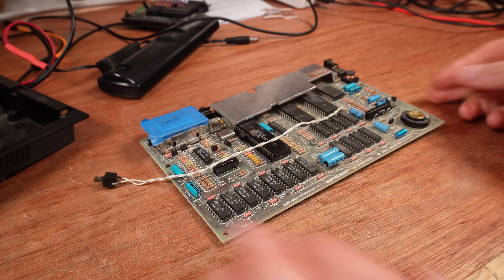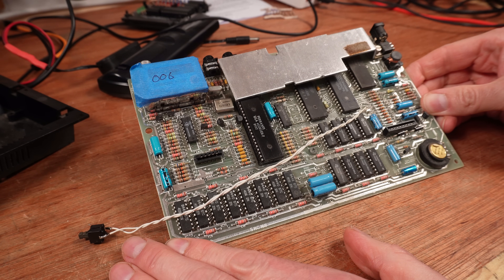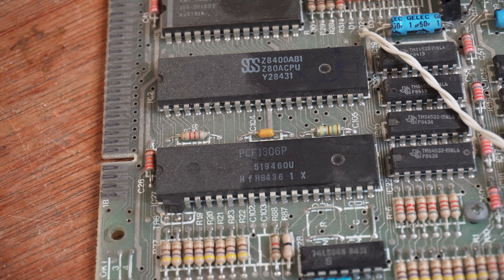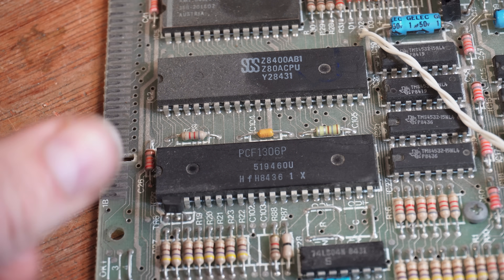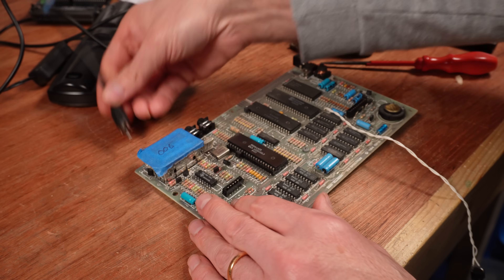This revision of motherboard is the final one before Sinclair upgraded the line to the 128K Toast Rack, and is usually very reliable. The ZX8401 chip, which replaced the four logic chips whilst adding another one, is over here and doesn't fail too often. They're not too hard to get hold of and there are even modern replacements you can build. Check out the video popping up in the corner of your screen where I build a completely new one of this exact revision of Spectrum from entirely new parts, mostly, including a ZX8401.